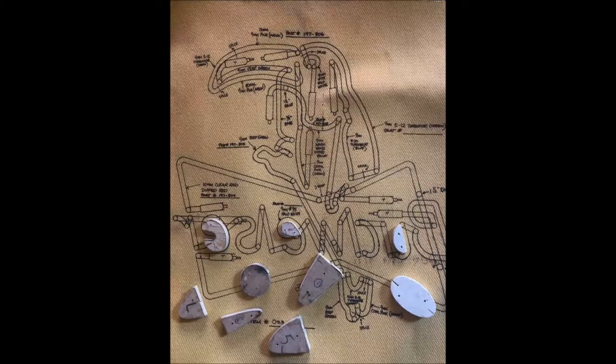Reason 5, they most likely used jigs to bend that original tube. I got this photo from a nice person who worked in the beer sign mass production, and these are some original jigs. They are basically heat resistant blocks and molds that you use to shape and pull the hot tubes around them. This way you can do several adjacent bends at once. You have some help in complex shapes and all your finished parts will look the same. Now with this background information, let's go into bending.